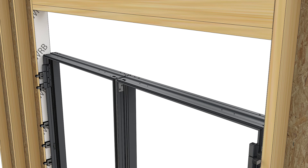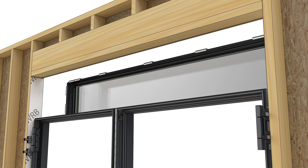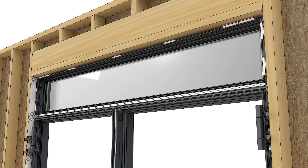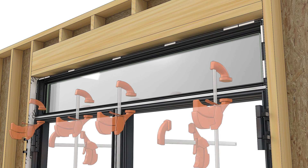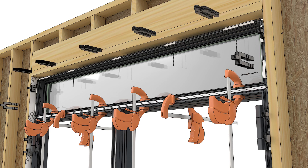Use the techniques outlined in the previous sections to apply a horizontal mull. Install the lower units first, then set the top unit above, being careful not to disturb the sealant bead until you have the assembly aligned correctly. Clamp and fasten the transom to the bottom unit through the installation holes on the bottom unit head jamb. Pin the top corners and plumb the top frame to the correct plane, then shim and fasten at the remaining installation hole locations.